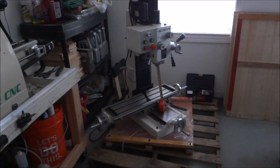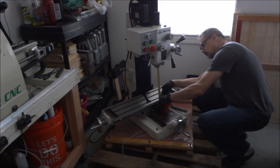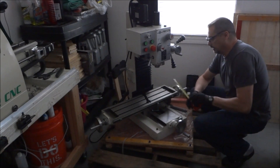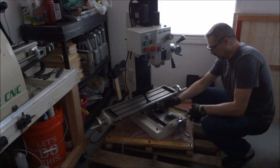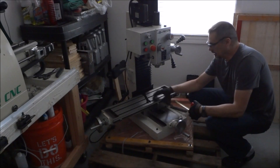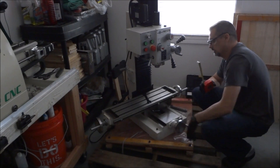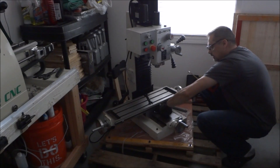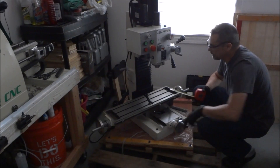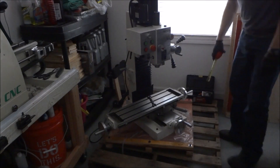Back to the Precision Matthews. So it was eight and a half that way, and spindle to here looks like it goes about to the edge of the table, so that's good. Now you can notice there's this big area right here, and I think I can notch this out a couple inches at least. So I'm thinking I should be able to get maybe 10 inches on my Y when I go to CNC it. The casting's not really thick there, so I should be able to just notch that out and get another two inches, hopefully.